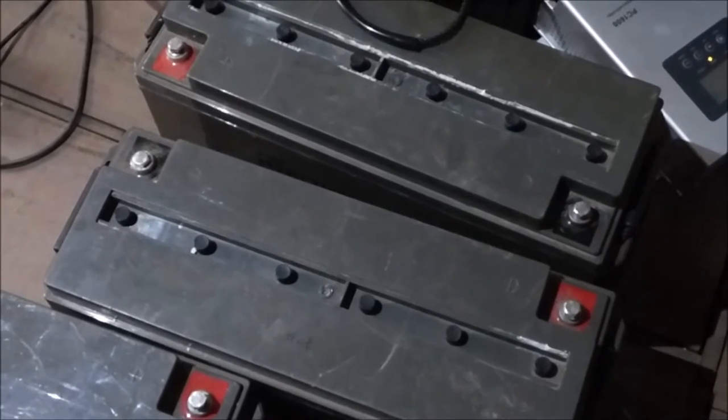Over here we have some Mercury batteries as well — an additional four of them. These are reading 12 volts; this one is reading 7.4 volts. We had challenges with this before. What we did was open the vent caps and pour some water in. Then we tried charging them. This one went from 12 volts to 7.4 volts under load. We're hoping to keep charging it and running a battery desulfator on it to break up the sulfation and get the battery back to at least some reasonable capacity.